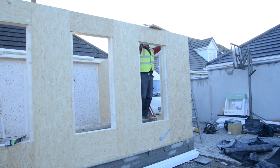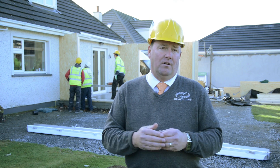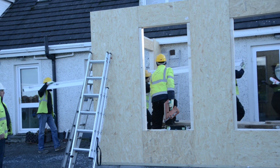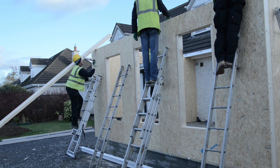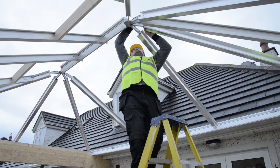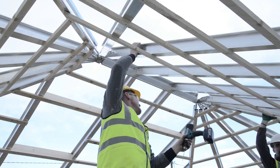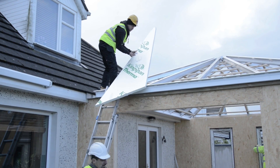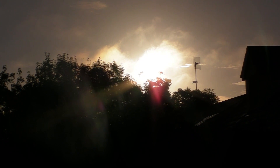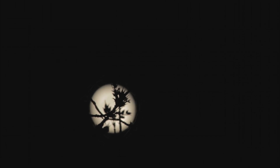With the walls complete, work begins on the superstructure of the roof. In order to perfectly marry the walls with a roof, we use our garage and roof system, which has been on the market for the last 14 years. It's a remarkable roof that fits and kits together in one day, giving a 0.18 U-value, which combined with the walls — giving a 0.16 U-value — creates an incredibly high-performance room, far superior to any traditional build on the market today. It's almost 6 o'clock and starting to get dark as the last of the roof's superstructure is finished, and the team cover the room for the night.